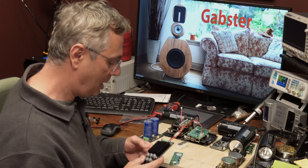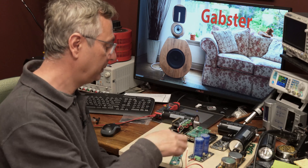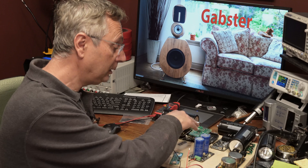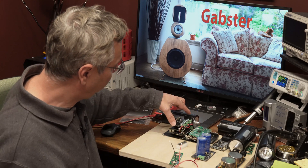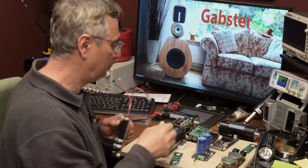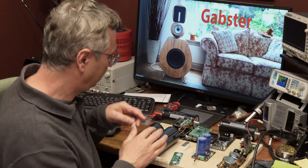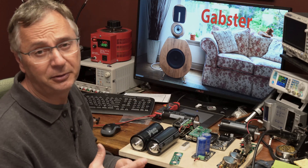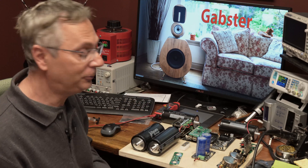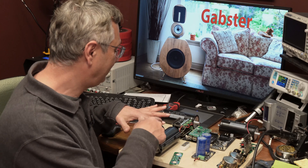We'll be powering the dirty side — the Raspberry Pi — with a high-quality linear regulator, plus some ultra capacitors to further reduce voltage noise. That side is less critical than the FIFO Pi side, which is where you really need the pure power supply, and that's where the large ultra capacitors will be used. We'll need about six to eight of them grouped to power the entire DAC. You could start with just two and power everything at 3.3V and 5V — that probably gets you 95% of the improvement — but you can also separate the power supplies further.